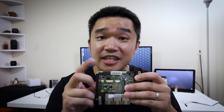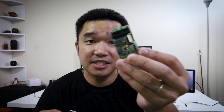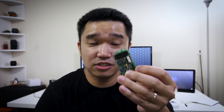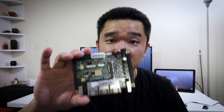The mPCIe slot can support a lot of devices. You can buy an mPCIe SATA controller to add a full hard drive, making this a great NAS server. I also have an mPCIe to regular PCIe adapter, which means I could connect a graphics card or other devices. Right now I have a Wi-Fi and Bluetooth adapter installed, which you can purchase as part of the Espressobin kit. The starting price is $39, which is a great deal for what you get.